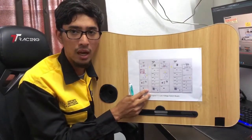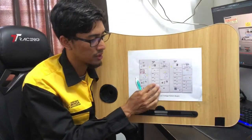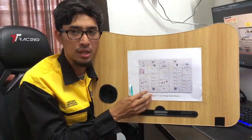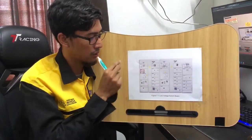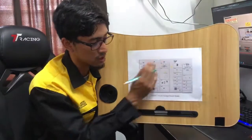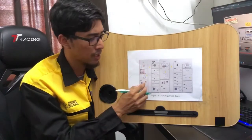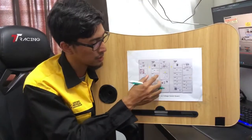Okay, and then when we have already checked the incoming and outgoing supply, we need to give the supply, which we connect to the bus bar by using the charging handle. First step, before we turn on the LVSB, we turn on the incoming supply to the switchboard, and then we give the connection for the bus bar, by looking at the status in the isolation part.